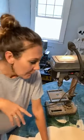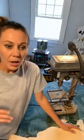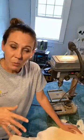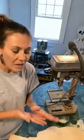Miss Debbie, this that I'm using today is my favorite, and it's birch. It's a 1/4 inch birch. But when I'm not using birch, I do use the 1/4 inch tri-ply from Home Depot. You can get like the Revolution plywood from Lowe's, but to me, I like the tri-ply better. It cuts smoother, and the actual surface of the wood is smoother.